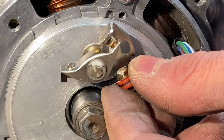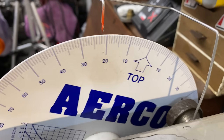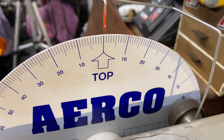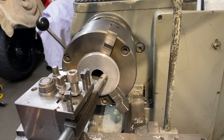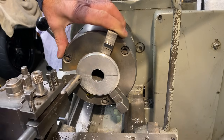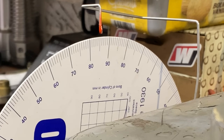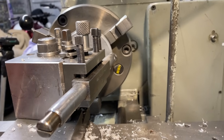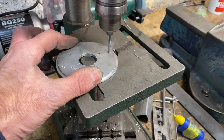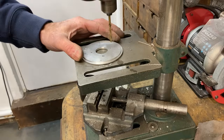The next thing I'm going to do is fit the four sets of contact breaker points. The contact breaker points are spaced at 90 degree intervals, so I first set my degree disc to zero, put the aluminium plate back in my chuck and scratch one line across with my tool bar. Then I rotate the chuck 90 degrees and scratch another line right the way across, giving me an accurate mark for drilling the holes. I can now mark out two holes for each set of points — one is the pivot hole and one is threaded for the securing screw.